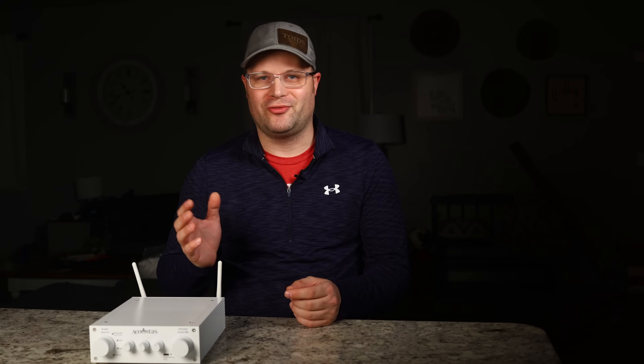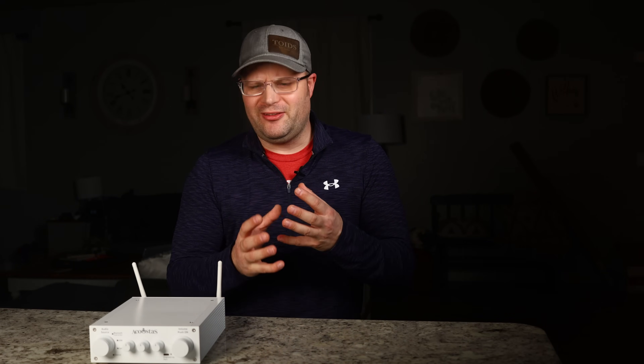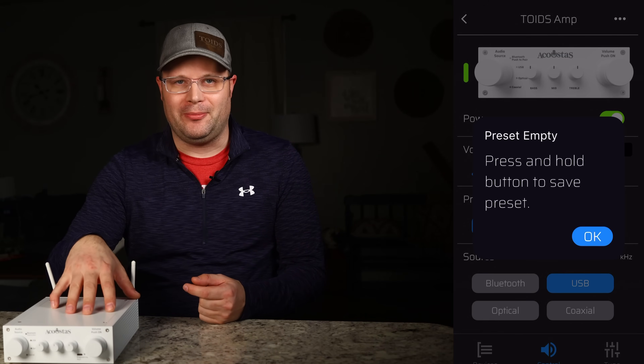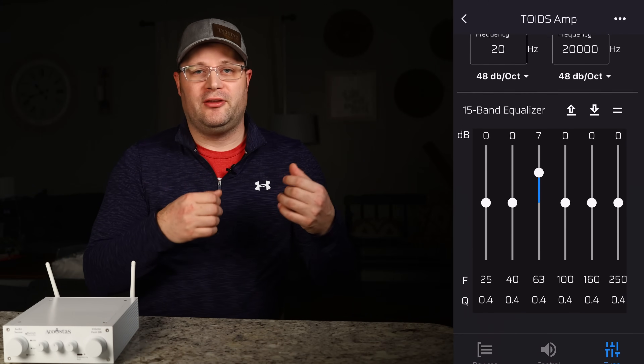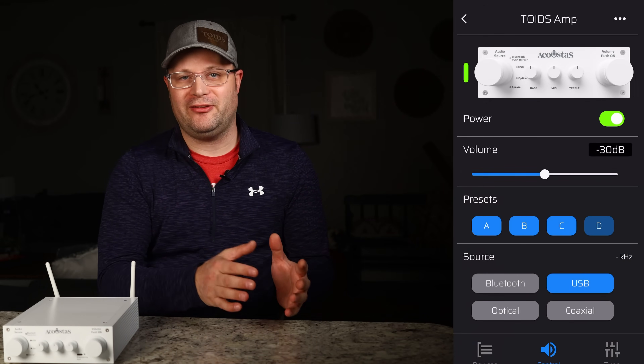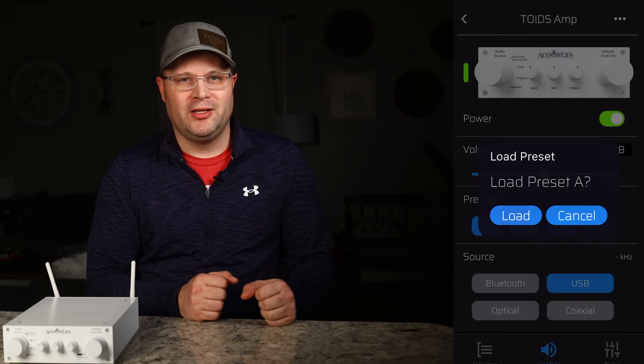That's not the end of the ease and flexibility of this amplifier. If you want to EQ your speakers for different genres of music or movies, you can easily set up four different presets, which can be switched to at any time within the app. This also works for those designing speakers — maybe you want to try different crossover points, EQ settings, or delays. You just set those up as presets and quickly switch between them, allowing you instant access to hear the difference. This has been a huge upgrade from my previous DSP amplifier, where I had to wait minutes for adjustments to be rewritten to the DSP board. The Acoustos allows me to instantly hear the difference, making working with it really pleasurable.